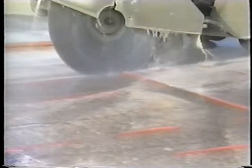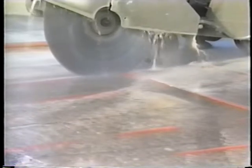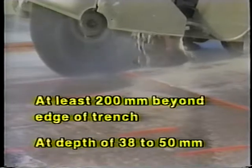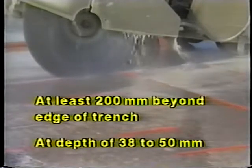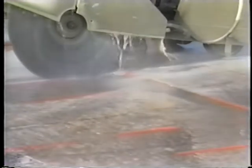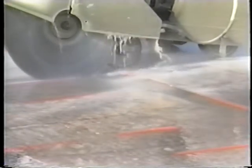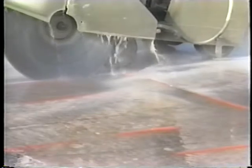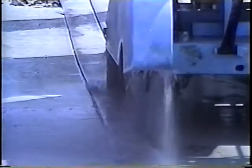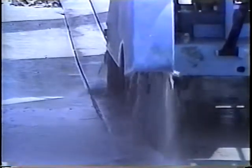When cutting concrete pavements, the outline of the cut should be sawed at least 200 millimeters beyond the edge of the trench at a depth of no more than 38 to 50 millimeters regardless of slab thickness. This saw cut will provide a straight vertical face that will not spall. It's a good idea to make additional less deep saw cuts parallel to the outline cut and a few millimeters away from it. These cuts provide a toe hold for the hammer's breaker point and help to remove the concrete without spalling the adjacent pavement.